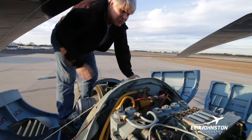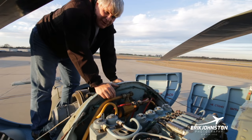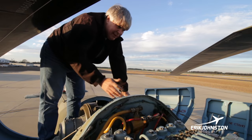Service tanks actually just gravity feed and mechanically feed the front engines with fuel, and they will drain in 30 minutes, so you plan on 20 minutes. And you need to be careful to be in coordinated and level flight while you're doing that, so you're not potentially starving one of the turbines. You can use the generator, it's only rated for 30 minutes of use. But again, if you're in a life and death pinch, you'll run it as long as you need to run it. And that gets you an extra 30 minutes.